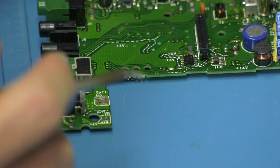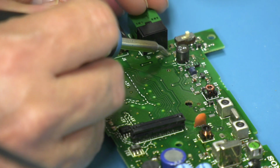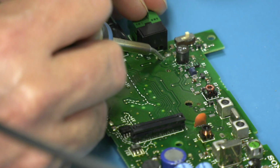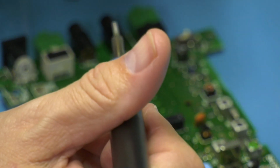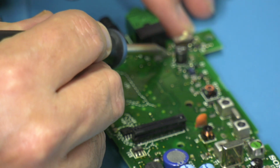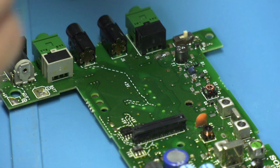Poof. That's that one. Got another one here that has a fishy smell. I don't know how else to describe it really. So I'm just going to see if these will take fresh solder till it sticks, which it's not. Let's use some of this flux, it's a bit more aggressive. See if I can get some solder to stick to that.